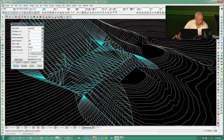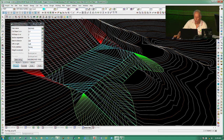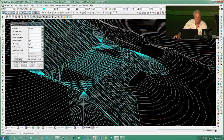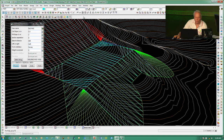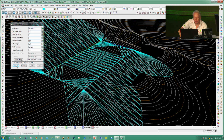If I go into here and raise it by two metres and process, it's moved the original building pad string up by two metres, rerun the job, and given me a new volume. I can keep hitting Process and watch it lifting and dropping — getting it to a stage where I'm happy with my design. I've got to about 5,100, so I'm a little light on cut. Going back to minus 0.5, dropping it down and processing gives me a reasonably good balance with a little bit of meat left over.